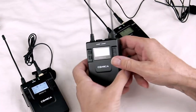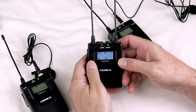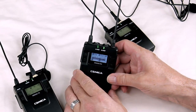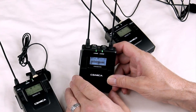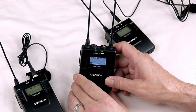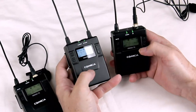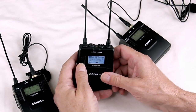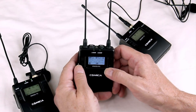So what we need to do is take our receiver and go into Group A. We're going to want to auto scan — we're going to hit Set, and if you look close, it's now trying to find the best channel that's clear for Group A. It's going to scan all 96 of the channels. It's telling us that for Group A the best channel is 47. We're going to hit Set. Now if we go into this one — this is Group A and right now it's on Channel 41. In order to get that to set with this, there's two ways to do it: we can either change it to Channel 47, or we can hit the Auto Sync button. Group A settings sync with transmitter — we're going to hit Set.